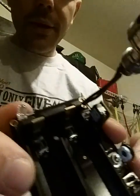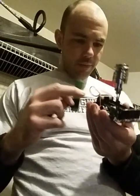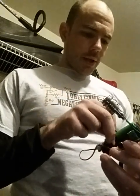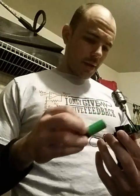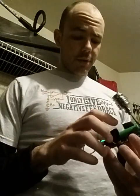Fuses — let's get the fuses because they're underneath. You've got your fuses right there. Two five-amp fuses. They are of a size where they'd be too tall if you tried to stack and make a 20-amp fuse setup. You can probably find seven-amp fuses that'll fit in there. Or you can just bridge the connections and do without the fuses. You can basically defeat all the extra features on this thing by bridging the connections with solder.